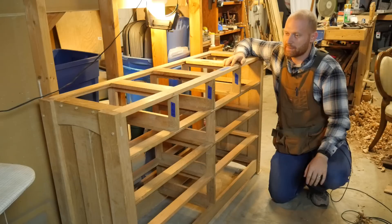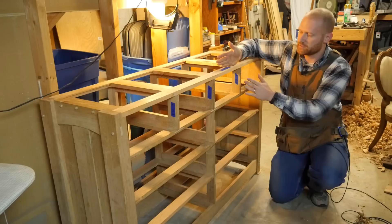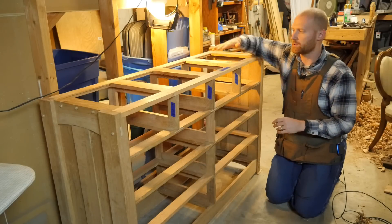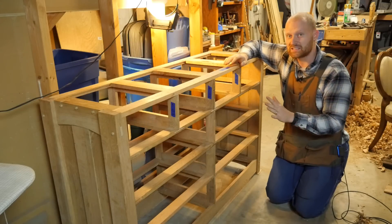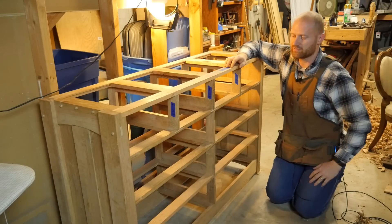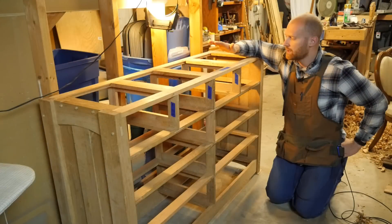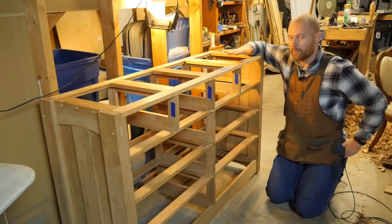I am very pleased with how this has come out. It's not exactly how I originally intended — things change along the way. Bringing this out to be flush with the front rather than inset was a different change, but I'm putting the main top on it so that shouldn't be much of an issue. The carcass itself is basically completely done. I just have to do some finishing touches — the tenons need to be cleaned up and shaped, and then I'll do some final smoothing and finishing before actually putting the finish on it. I still need to make all the drawers and then make the top. Sounds easy, but it's not.